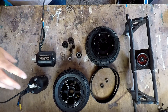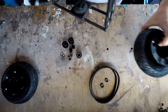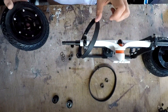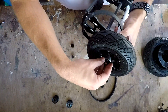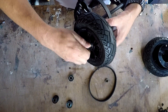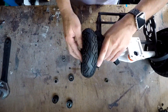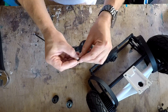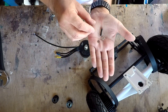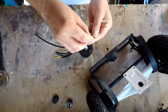I'll be starting by putting the wheels and the motors onto the trucks that I built in the previous videos. In a hope to stop the motor from slipping, I've used a spring washer and a flat washer around the screw before I mount the motor to the framework.